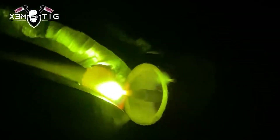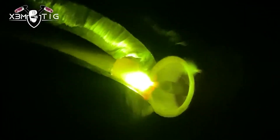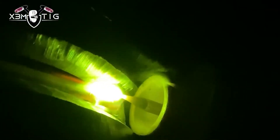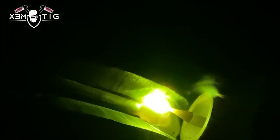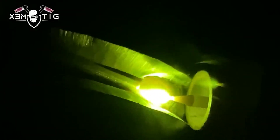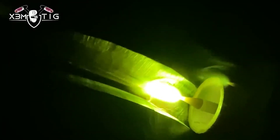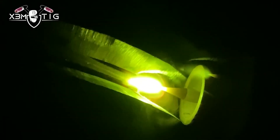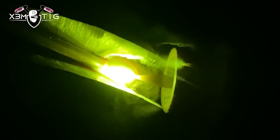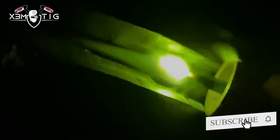Once I preheat both sides, make my connection — that start point is most important. You just want to keep that rod inside, above that edge from the inside, and just constant feed. Back feed is most recommended, especially when you're free handing. But if you're in the field and there's not much room above, you can feed it from the side.